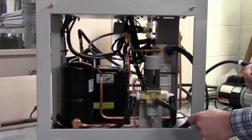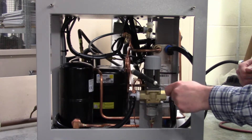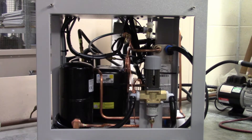The water regulator is the component within the system that changes its behaviour most compared to an air-cooled system. This component reacts to pressure that it sees in a capillary tube, which is connected to the high side of the fridge system. As load increases in the system, the pressure will increase on the high side, and as a result the water regulator will allow more house water to flow. Likewise, if the load disappears in a system, pressure on the high side should also reduce, and the water regulator will reduce house water flow rate into the condenser brazed plate heat exchanger accordingly.